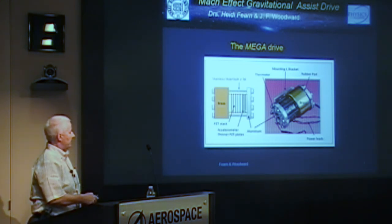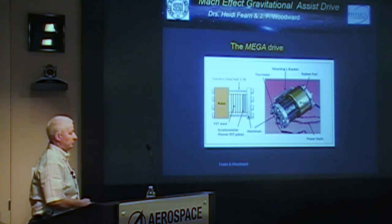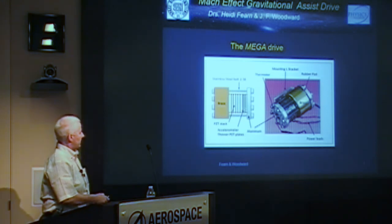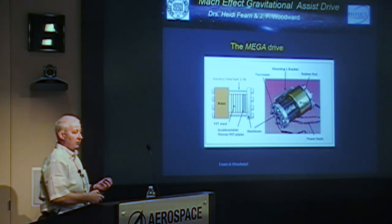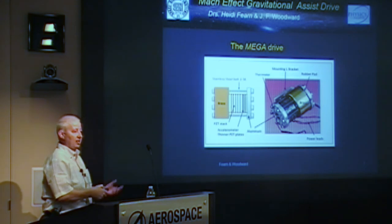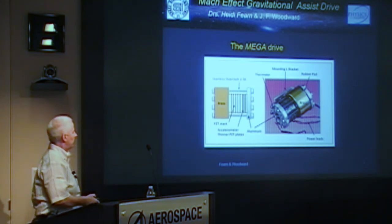Of course, between all these things, we've got brass electrodes, and all the grounds are connected together, and all the positives of the 8 plates are connected together with the tabs so that we can put the power to them. But then the thin electrodes have their own positives so that we can just take out the current that they produce. So those thin ones are not powered. We actually take the current and voltage from those to get the strain gauge information out.